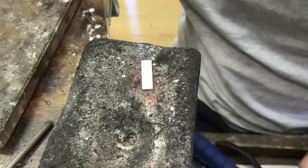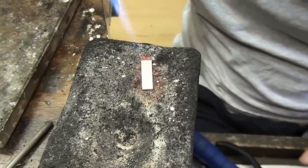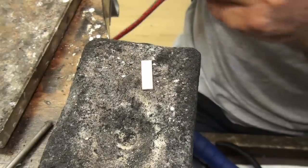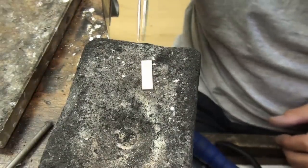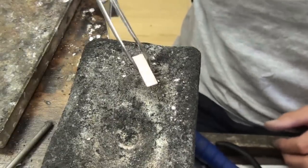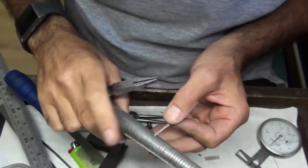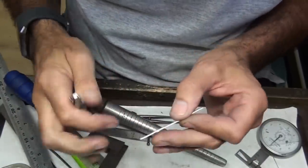Place your silver on charcoal if you've got it, turn your light off and you can see the color change. You just want it to go to cherry red, then take the flame away. It should be a neutral flame and not too hissy. As soon as the brightness has gone out of the silver and it turns a little bit black, quench it and pickle it.